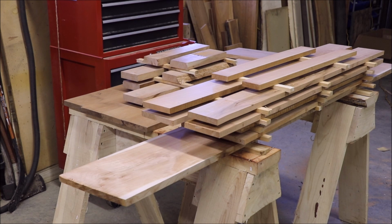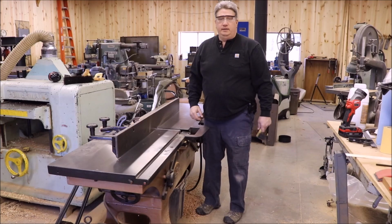So check it and make sure that you're dealing with flat stock, because the worst thing in the world is to try to get good, accurate joinery when your boards are all warped and twisted, because you're just not going to get good results. You're going to attach the door to the front of the cabinet. Nothing's going to be square. Everything's going to be flopping around, and you're going to say to yourself, what's going on here? So this is the best way to eliminate it. Also,